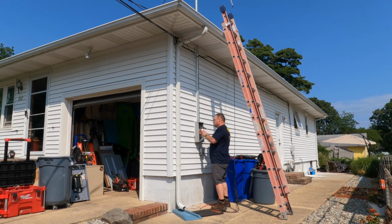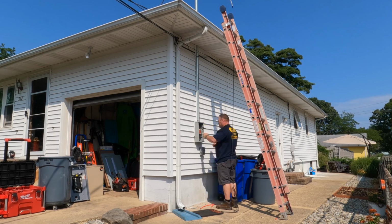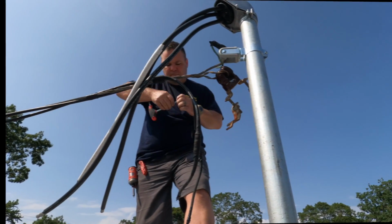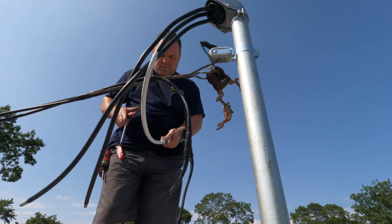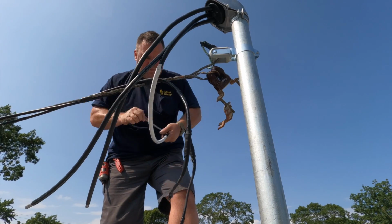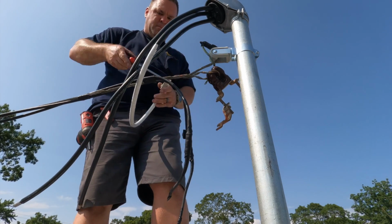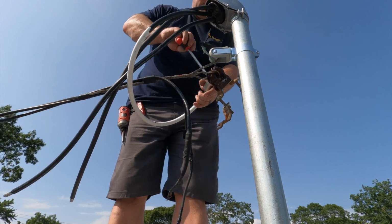It'll do your kids' video games, their iPads, the charger, obviously the phone charger, your computer. If you have a boiler, you could set up your heat. If you have forced air, it'll take care of your furnace. It won't do your central air conditioning, but I would start at 6,500. And I would suggest even getting an electric start and just charging that battery. So if you're not home and somebody who's not that strong can't start a generator, electric start just has a push button.